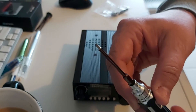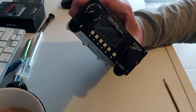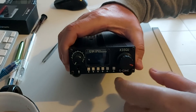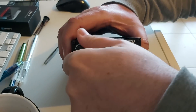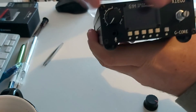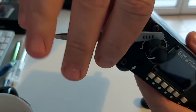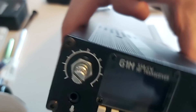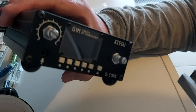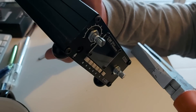You do need a hex driver for this. I'm going to start by taking off the faceplate. I have to remove the buttons — pulling them out, a little harder on this one. For the volume knob I'll use tweezers for leverage. Then I remove the nuts on the potentiometers, being careful not to scratch the faceplate — start them and then finish by hand.